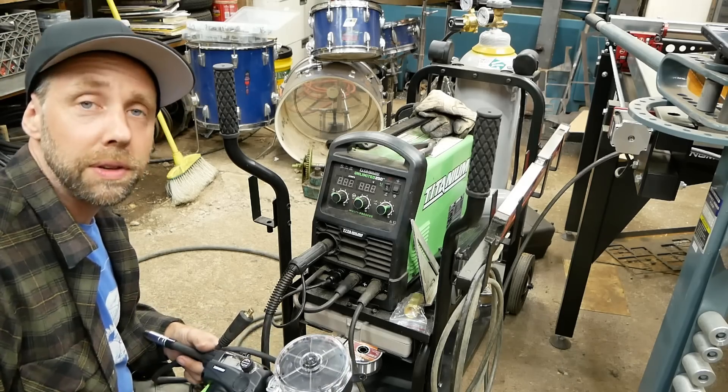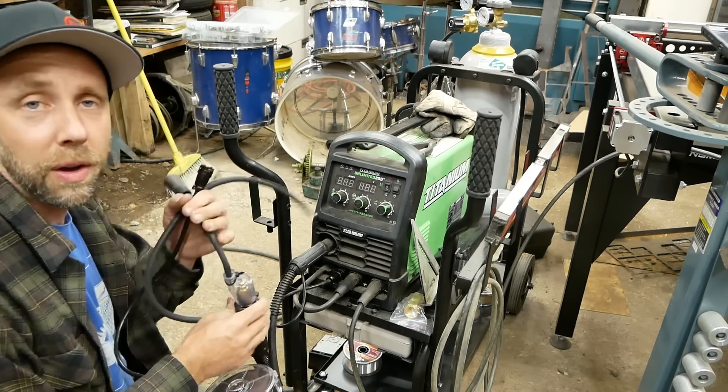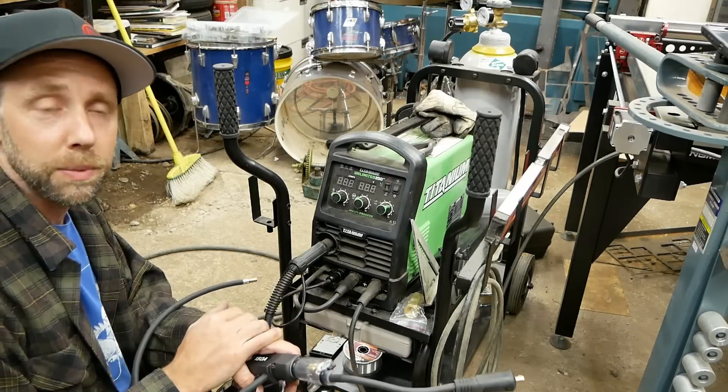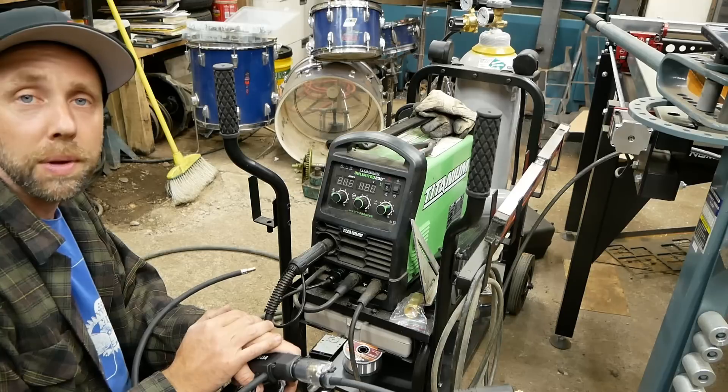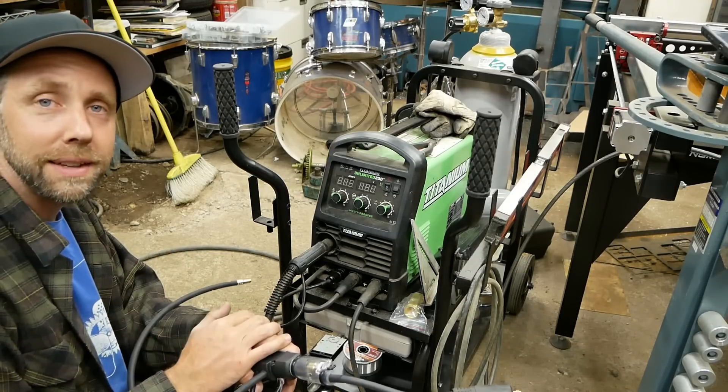You're going to probably do more welding of aluminum projects with this. Now, some people might say that's great, but if you have a solid block like this, it doesn't run gas to the center — but my spool gun runs gas to the center. I'll show you a quick little terminal I built to actually hook an Omni Pro up to a Miller spool gun.